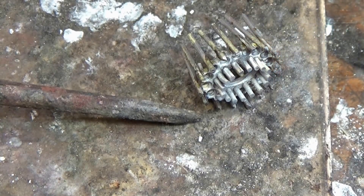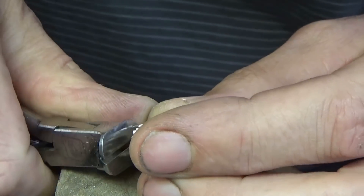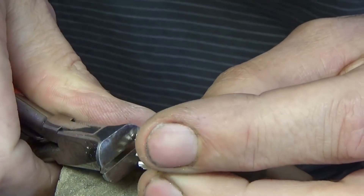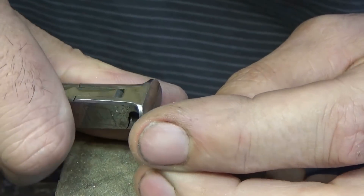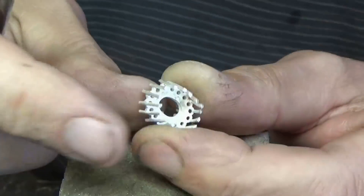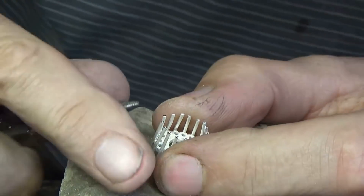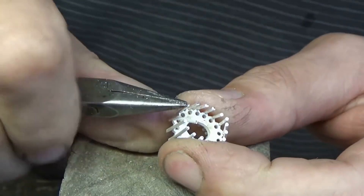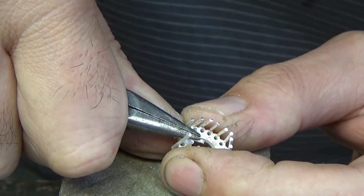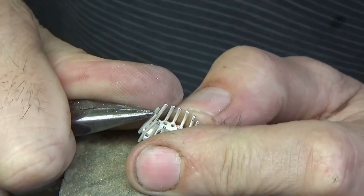Before I quench this I'm going to just check all the claws — let me just shorten them first, and I'll probably need to shorten them a bit more later as well. If I push the two end claws from the long ends over first and just see where they meet up, this is also going to determine the height of the ring head.